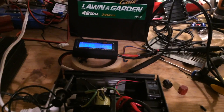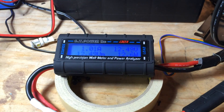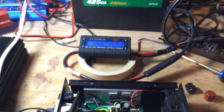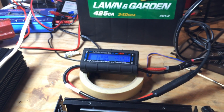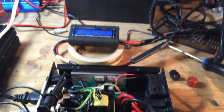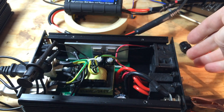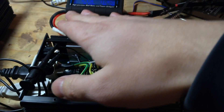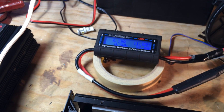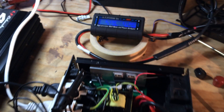So back to trying to power this thing up — let's see if it browns out this time. We're holding rock solid at 12.5 volts, pulling 12 watts, which is about right for this little LED. There's also some loss in the inverter itself. I'll also turn on a 72 watt bulb over my shoulder — it kicks on the fan and it's pulling quite nicely. That's about 100 watts for a 410 watt inverter, so I've got quite a ways to go. I need to get more light bulbs — pull old incandescent bulbs out of the closet.